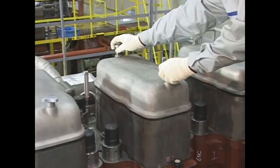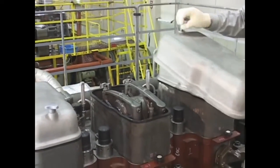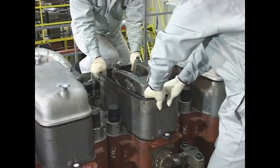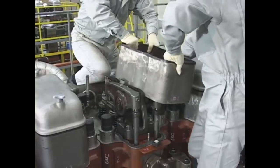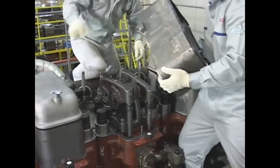Open the indicator safety valve of the cylinder head. Just after the engine stops, it is hot. When handling the cylinder head, wear protective gloves and take care not to burn your hands. Remove the exhaust pipe cover, the heat box cover, and the cylinder head cover.